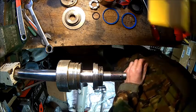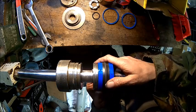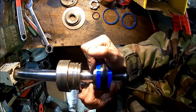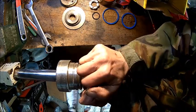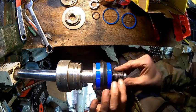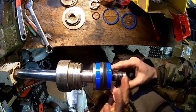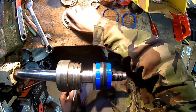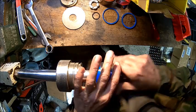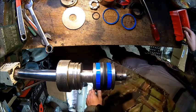The seal pack. This is the seal pack which goes on here. Should normally fit easily. The direction doesn't really matter, because it's a bi-directional piston. Don't forget the O-ring. You shouldn't roll them on, but there's a thread here, so, and then just put the rest of the piston in. If we have anything left, no, we don't. The washer.